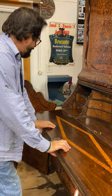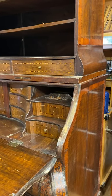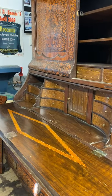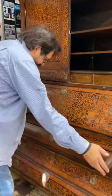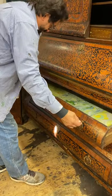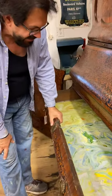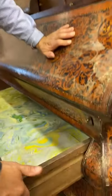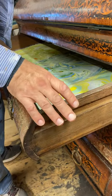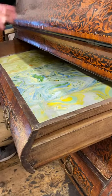Just take a look at the massive size. This piece needs massive sides — it's tapering out to about an inch, inch and an eighth. It needs a very large superstructure to hold this together. And then taking a look at one of the drawers — some lovely marbleized paper. I wonder if it could be original from the 18th century. People didn't want to see the raw wood of the drawers — they didn't want their cashmere sweaters to catch — so they put this down on the bottom. Typically in Dutch fashion, the drawer is sliding on a runner, which is good for this type of carcass work because it's so big and racks so easily.